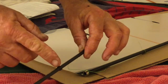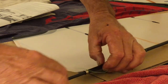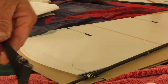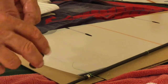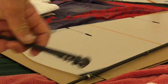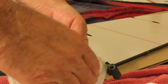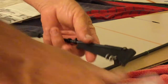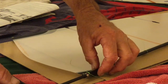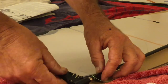You're going to stick the mast tube in. The beveled edge is facing down. That's going to slide right in there. I have a lot of Vaseline on this. The bearings of your boom here are going to corrode, especially if you're sailing in salt water. So especially take your Corrosion X, and make sure you put an absolute ton of it on here. Okay. Then you're going to take your boom and slide it up from the bottom. There you go.